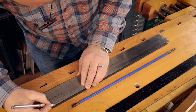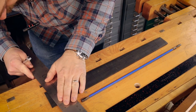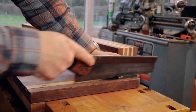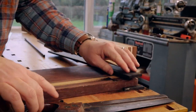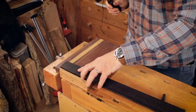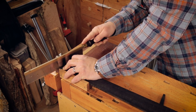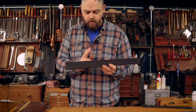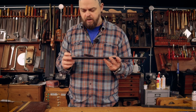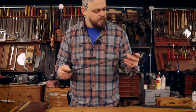We're marking where the 23rd fret is on that, and on that. That's my final cut. Bench hooks are fantastic, but they do work better when they're actually clamped down. I'm using the Crimson fret slotting saw which made the original cut, so I'm not going to move the nut in any way. We are going to be binding it in burl maple to pull the whole guitar together. I probably should have moved that cut by the thickness of the burl, but I don't have that yet, so I will do that on a sanding machine in a minute.